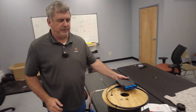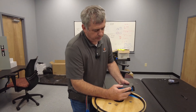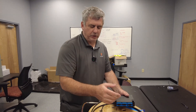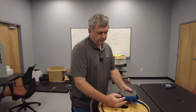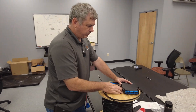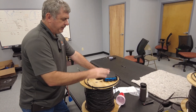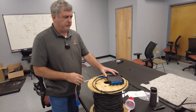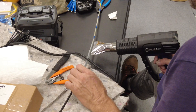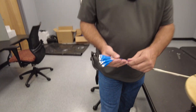We're going to try some with LC — Lima Charlie — connectors, but they're really delicate. So for this proof of concept we're going with SC, and the person doing the fiber deployment could use an SC-to-LC jumper that's almost disposable. We'll mount this onto the spool rack, put another spool piece here to protect it. You can see this is the end of the spool and we heat-shrunk it.